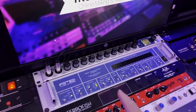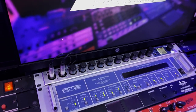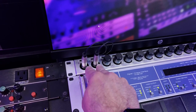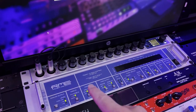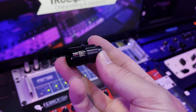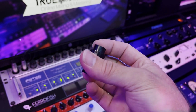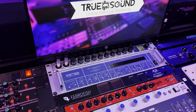Okay, so this is what we got — this is the RME 12Mic. Right now this is my line in for all the analog gear, and it comes back into the DAW through these two inputs. I'm going to have a patch bay in the back that'll switch these from the TRS line inputs to the two microphone inputs, so I can still run 12 full microphones on this. I actually have 12 of these low-profile XLR connectors. You got your XLR plug, it's just very small — it doesn't have the big tail coming out of it. You can actually adjust where the wire comes out of it, rotating it around to get the wires wherever you want, which works out nicely to go straight back behind the monitor where you won't see it.